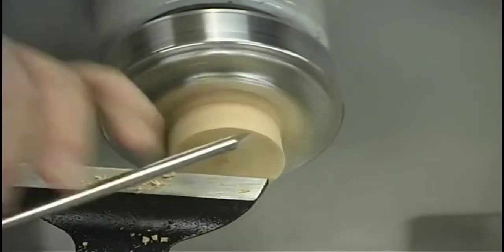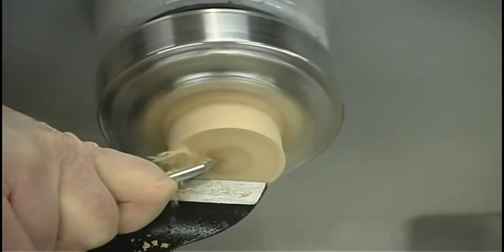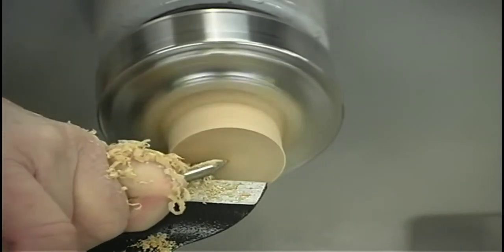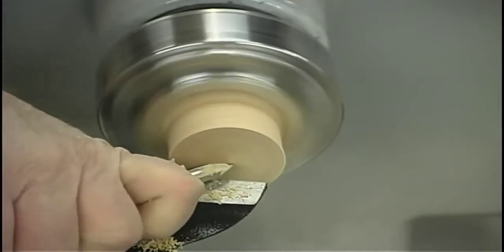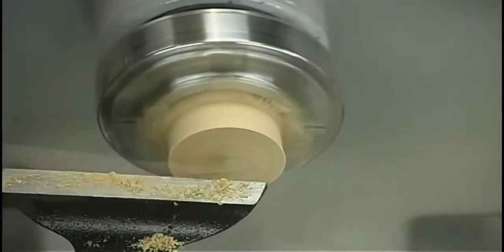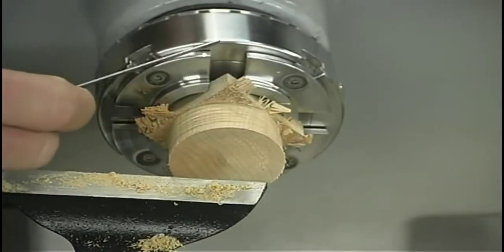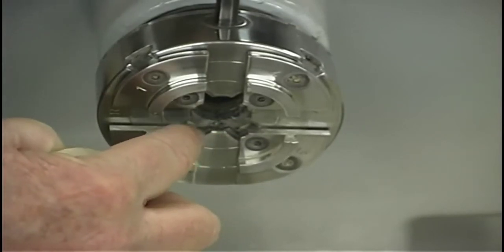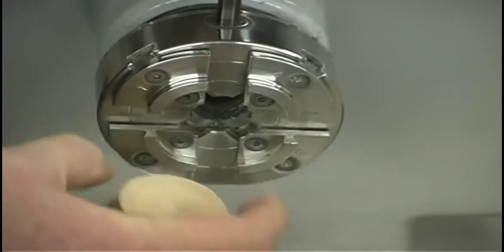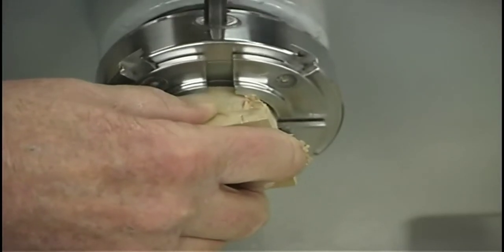I've turned my diameter, and at this point I'm going in and facing off the end. I want to keep it relatively flat because it's going to help locate in the chuck forming. When we turn this around, we're going to need a flat surface to set in our jaws, which will help keep everything concentric. The bottom of my jaws are flat, and I've made sure that the screws are recessed slightly below the jaws. That makes the jaws nice and flat where I can put my workpiece against them